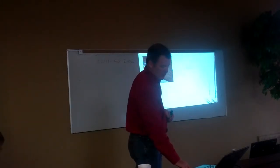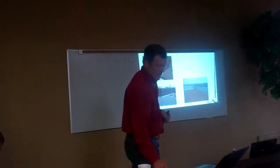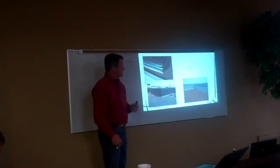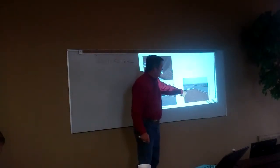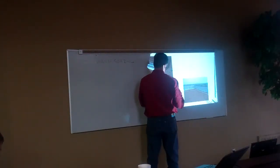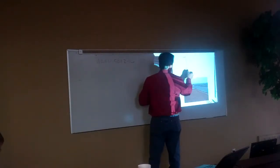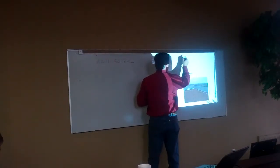Making sure that your flashings are all installed. We use these photographs because this is the type of roof going on this building, but you can see how we come up and put a hidden turn bar here and actually wrap it. That detail right there looks like this: this is your parapet, there's the turn bar, the roofing comes up behind it, it's wrapped, goes up and over.